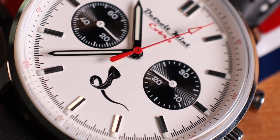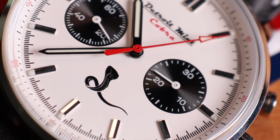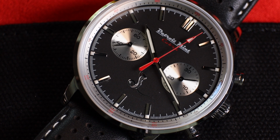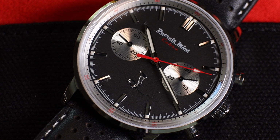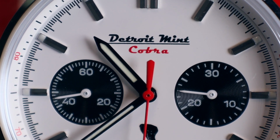One of the interesting things with the chronograph is not only are you measuring the full 60 seconds on the main dial of the watch, then you've got the sub dial obviously as part of the chronograph. Instead of a tachymeter, he's put 1/100th of a minute timing around the outside, which actually makes it a lot easier for timing than having to do a mental calculation with a tachymeter. And I think this was something that he took from those vintage watches of the time.